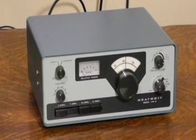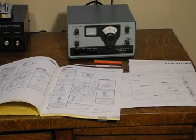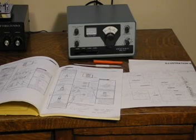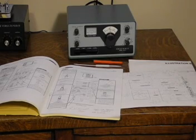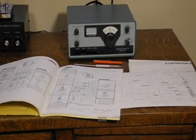It uses a relay and has an adjustable transmit-receive delay. The unit needs an external 12-volt power supply; Heathkit offered the HWA-71 as the official one. If you've only seen pictures of it, you may not realize just how small it is in real life — not much bigger than a book. It's nine and a quarter inches wide, four and a quarter inches high, and eight and a half inches deep, weighing about four pounds. This makes it suitable for portable operation. The kit came with the usual excellent Heathkit assembly manual, including a large schematic, block diagram, and fold-out assembly drawings. Alignment requires a reference receiver and vacuum tube voltmeter, and preferably an accurate signal generator. It even came with two alignment tools and a dummy load.